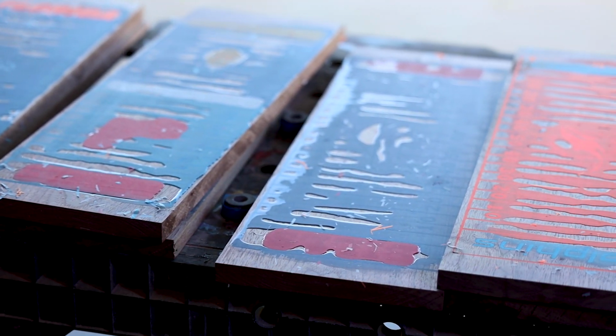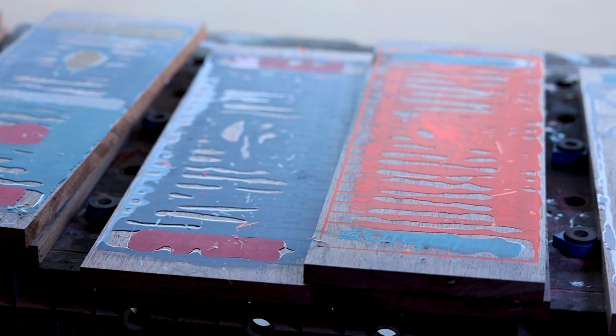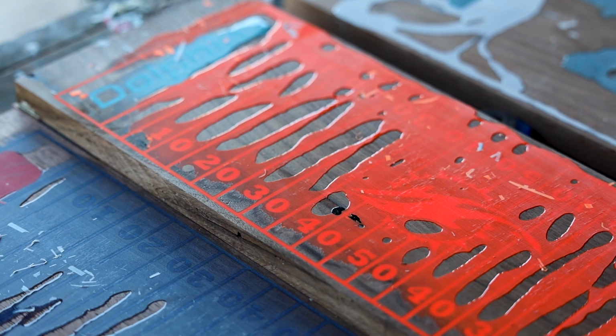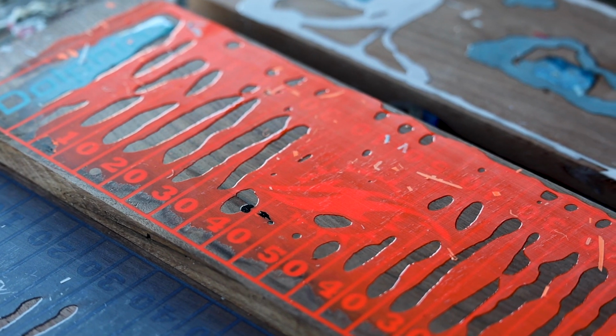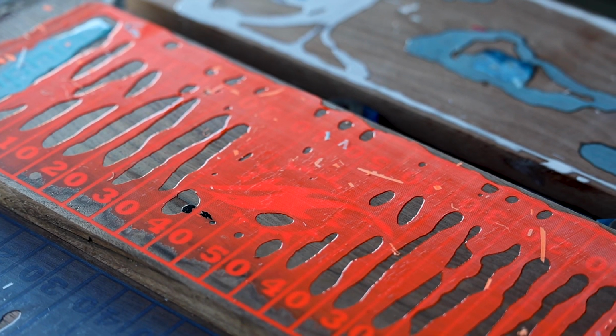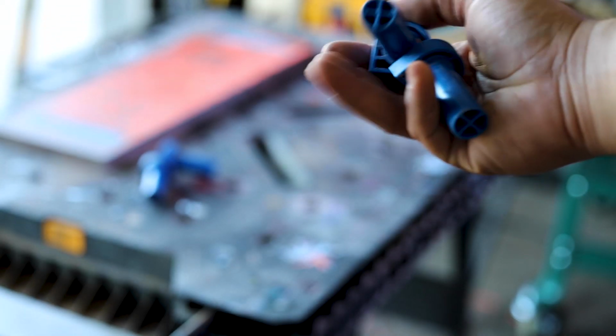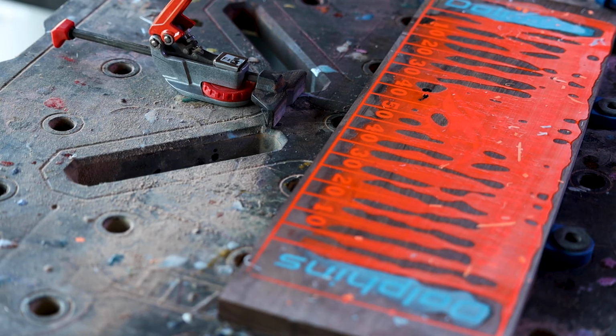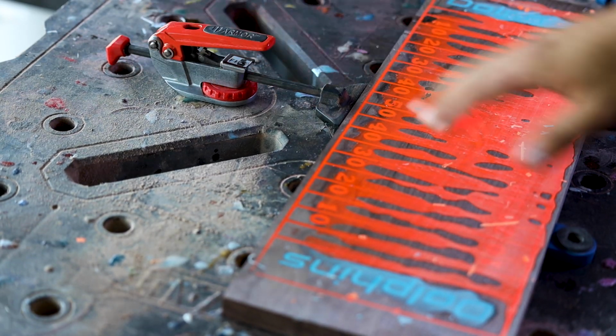You will see at the end when I'm done with the planer that I leave just a tiny little skin of epoxy on there, and that's where I leave it, because if you go too much you'll start to chip. You'll notice that sometimes you get lucky and it won't chip and you're like, dang, I'm unstoppable, but it's not like that. So I do recommend leaving that little skin of epoxy. It doesn't take very much to sand.